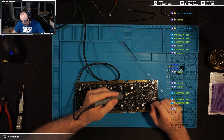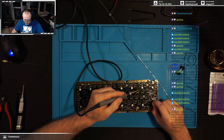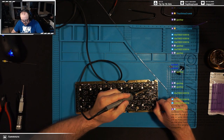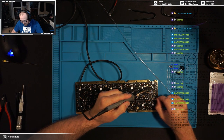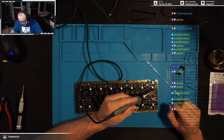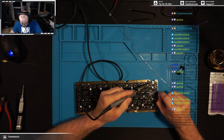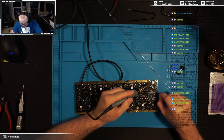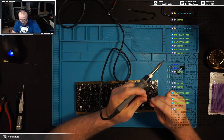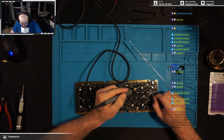If you think to yourself, well, I have no good way of fixing this through-hole component to the back side of the board so that I can solder it, please, I urge you, use tape. If it's going to get hot, they make Kapton tape. It's not cheap, but it's not that expensive. If you bend the pins over as they exit the back side of the board to keep them in place, I'm not saying that it won't work. It will work. And I'm not saying that it's always the wrong thing to do, but in our community, using the types of boards that we use, unless it's a super replaceable board, I cannot urge you more strongly not to do that,